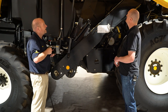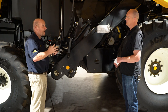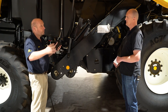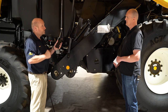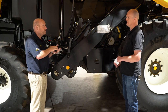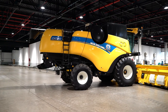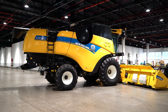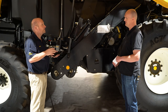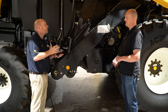At the top of this clean grain elevator, where it transfers over into the bubble-up auger, that is where we have a mass flow sensor. As the crop drops between the two, it drops onto the mass flow sensor and it weighs it. The good thing about the mass flow sensor is that a ton of wheat is the same weight as a ton of barley, as a ton of rape, as a ton of oats — a ton is a ton is a ton. So we don't have to do continual specific weight calibrations for different crops throughout the day.